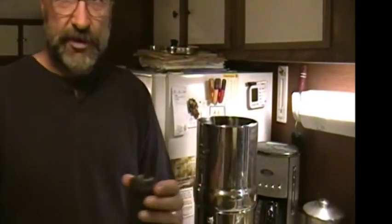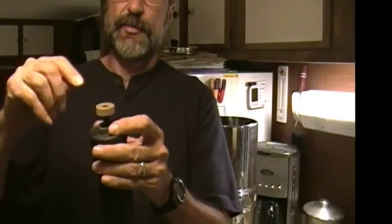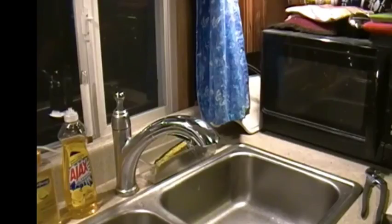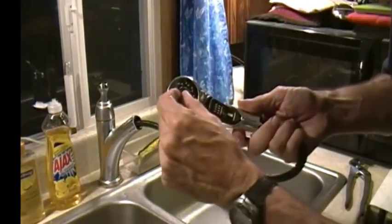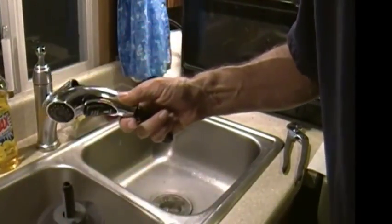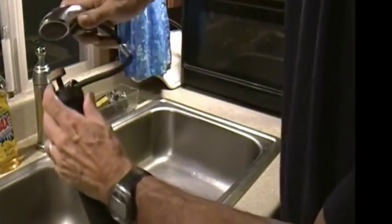Now, the way you do that is you take this little gasket that they've provided, this little rubber washer, and you put it on there, and then you put it on your spigot, and you run water under pressure, low pressure, but pressure down through there until it starts to sweat. And at first I thought, well, there's a gasket here, a rubber washer here, why can't I just use that? But this is loose, and here, let me show you my spigot. So here's my kitchen spigot, and notice that it has a solid face here. There's no way to take that cap off and get a hole in there, which means that I can't press that up against there because there's nowhere for that to go in there like that. So what I have to do, this fits tight, not like this is loose, this fits tight, and then I can press it against it like that.